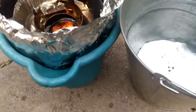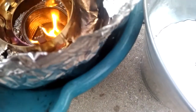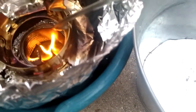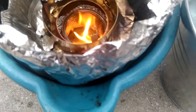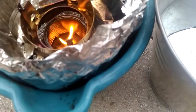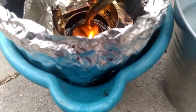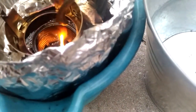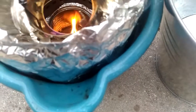Let's talk about the airflow. Air flows from the bottom of the container as primary air — that's the first thing, with pellets on the bottom. The second thing is these rectangular slots on the can that provide secondary air. You notice how the flame goes up to about here and then stops, and that's because of this device which produces very hot air, causing all the remaining gases to burn — so there's no smoke and no smell.